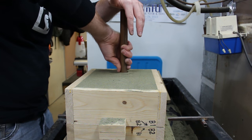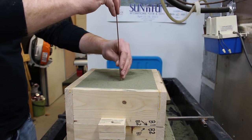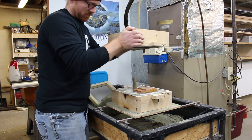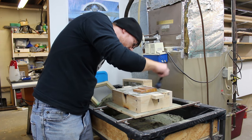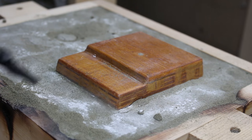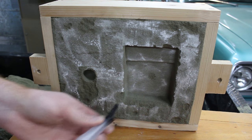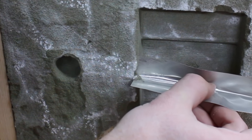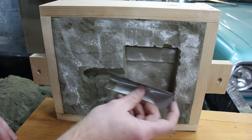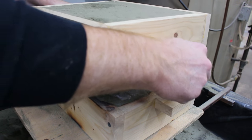Here I'm cutting the sprue and forming a little pouring dish. I insert a rod to tap the pattern so it comes out of the bottom of the cope, then clean up the pattern. You tap on the pattern to help it release from the mold. I've converted a turkey baster to blow the sand off. Then you cut a gate between the sprue and the part.